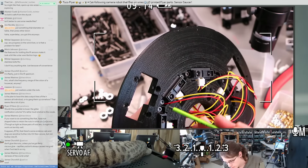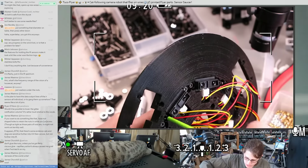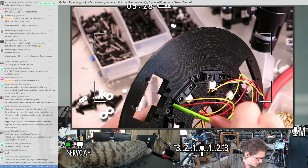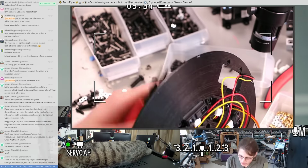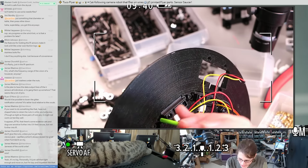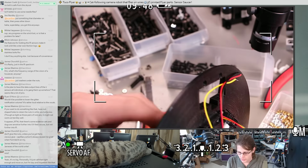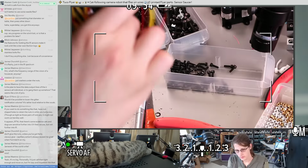Before I worry too much about how the wiring harness works, I just want to test the sensors. So I'm going to use a little tiny breadboard for power distribution. How do I get these sensors back to the... I need the breadboard for little resistor dividers also, or no, that's not true, I'm getting this confused with a different sensor. The analog output of this can go directly back to an I/O pin. So it just needs some way of connecting this wire to a jumper. All right. Got that.